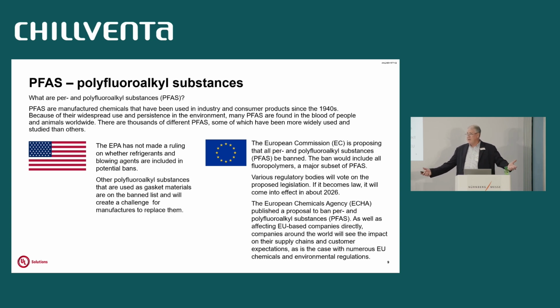Another thing that has been thrown at this industry again is the PFAS. We look at most A2L refrigerants are PFAS. The blowing agents for the insulation in commercial refrigeration, the chemicals that are in there, they could be banned. And I know we're having discussions in Europe here that the vote is coming soon, and as soon as 2026, we could lose the A2L refrigerants. Now we're basically CO2 or one of the propanes or something that's an A3 type refrigerant, which brings a whole new issue for this industry.